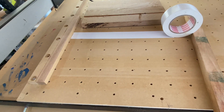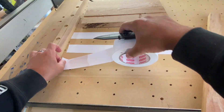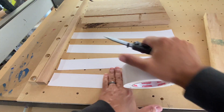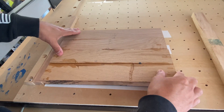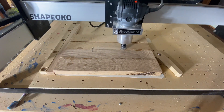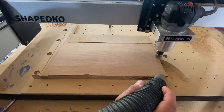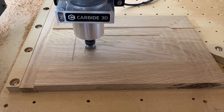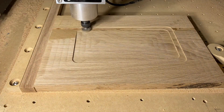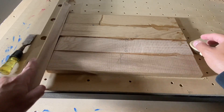If you're a new CNC user and don't have any clamps to secure your material yet, or you're in need of some good double-sided tape, X-Fasten double-sided tape is amazing and the way to go. You'll see later on how strong this really is. Once your material is secured to the waste board, run a surfacing job — I have a video on how to do this linked in the description below. This method works 100% every single time. Just repeat the process until the entire board is flat, then flip it over and do it again.